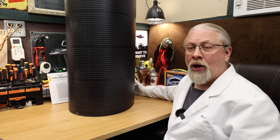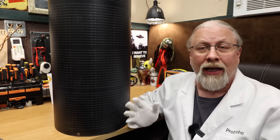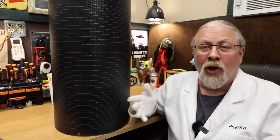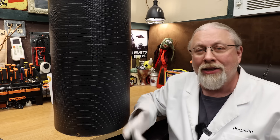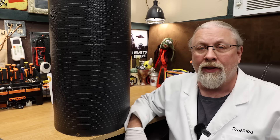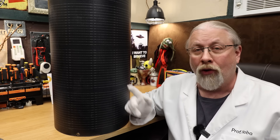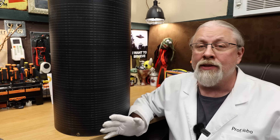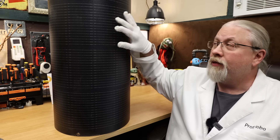So what do I think about the Arch Pro? I was actually very impressed by this product. I went into this test expecting anywhere from ho-hum to maybe half-decent results, but they actually exceeded my expectations. I did get a little carried away blasting the panel with 10 shots instead of just five or six, but I wanted to find out if this panel still output anything at all under such severe damage. A few of those shots actually penetrated the backing, leaving real holes all the way through the fiberglass. That is pretty tough. Even so, it still outputs an impressive 108 watts. Even shading three out of four bus bar sections, we still saw 124 watts.